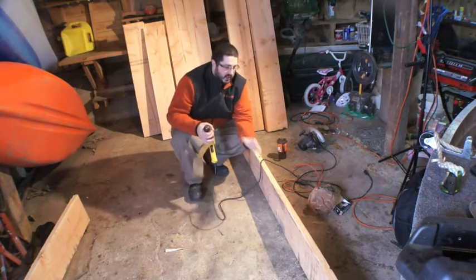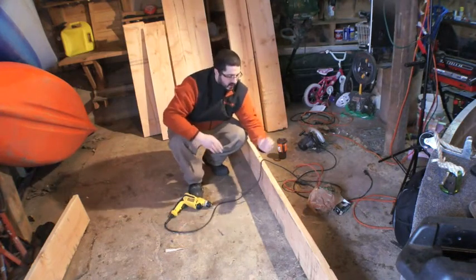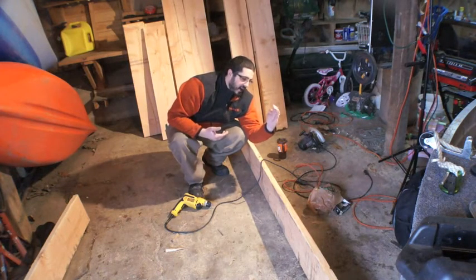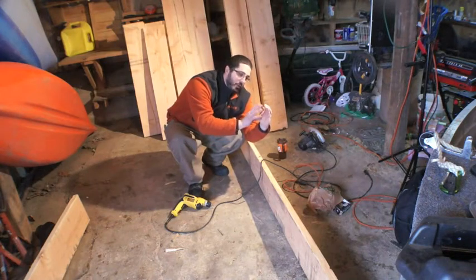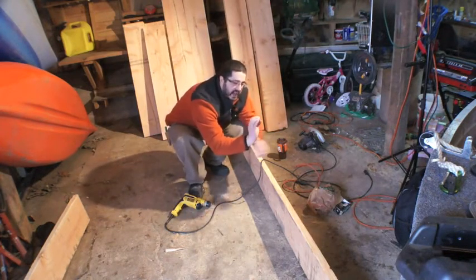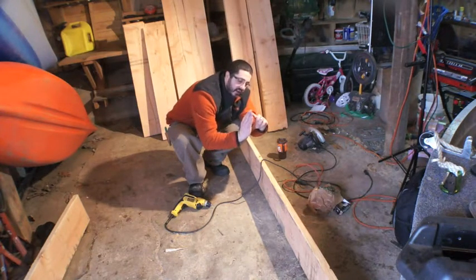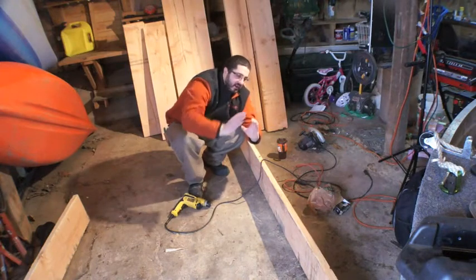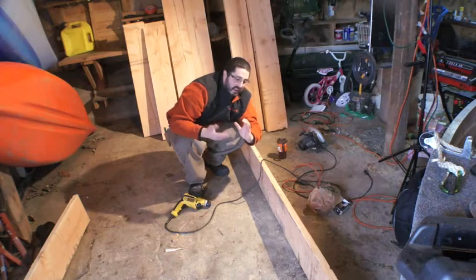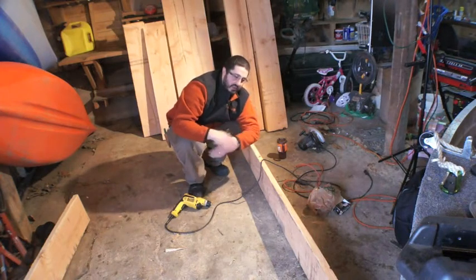Another tip: these planks of wood all have an arc to them — not lengthwise, but across the width. This piece of wood kind of bends like this. I've found it's easier to take that arc and put it so the mouth, if you will, is facing the piece of wood you're screwing into. Because if it's facing outward, your screws are going to try to fight to bend that wood back. Instead of fighting that, put it the other way so everything kind of is already where it wants to be. The only thing you're fighting is maybe the middle, and usually that middle screw will suck it all together. You won't have any gaps. But again, we're just talking about raised garden beds — it doesn't need to be perfect. If there's a little gap in the middle, not a big deal. Dirt's not going to come out of it.